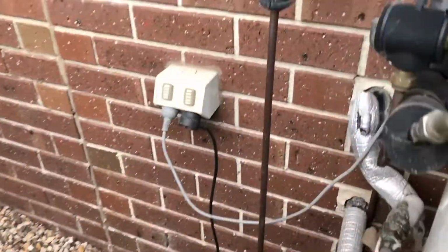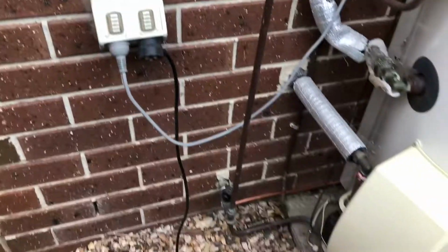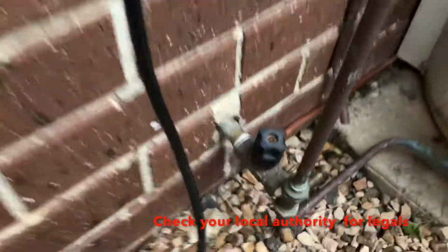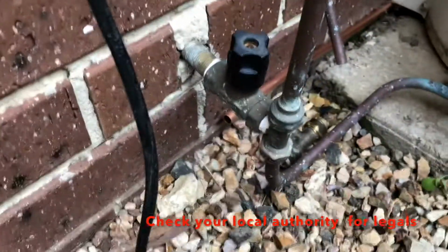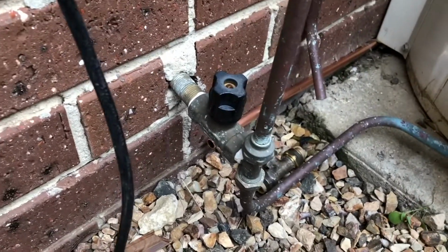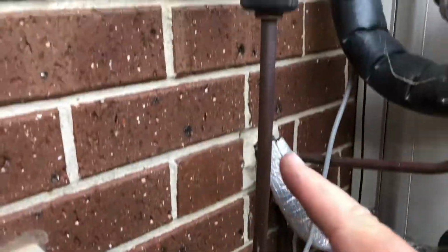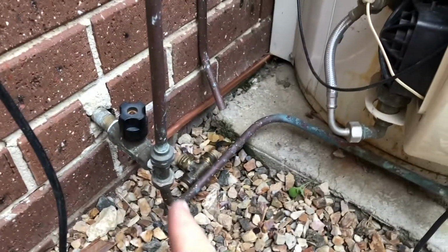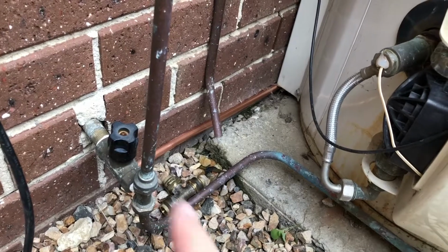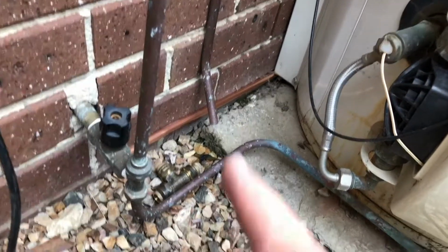So of course, there's cold water coming in to service it. So the plan is, this here is where the cold water comes in, and very conveniently it's got a tap so we can turn it off at that point. And it then runs up here. This is the over temperature valve where the cold water runs up, and this down here is where it comes into the hot water service. So from any of these points we want to then tap off.